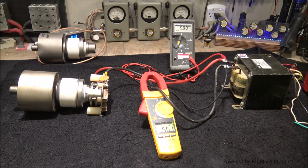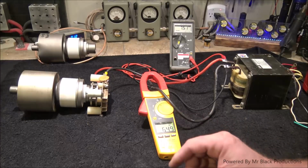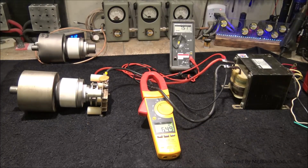Now, I know that this thing was run not too long ago, and I strongly feel that this won't be the problem. This tube's junk. So, as the tube comes to the end of its life in operation, it'll pour more filament volts, a lot more, like this here. Now remember, what we want to have is 51.5.